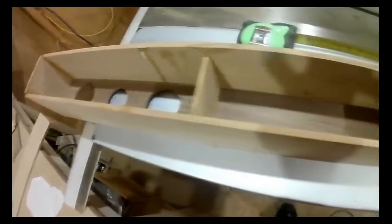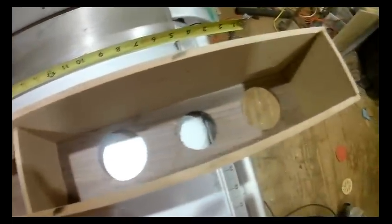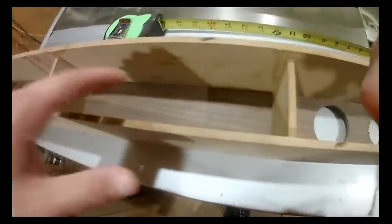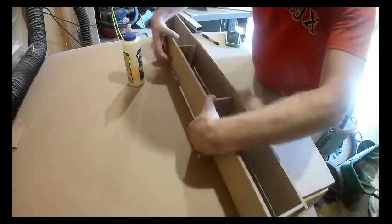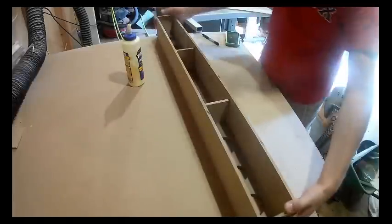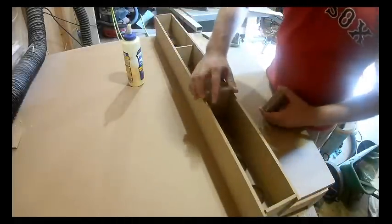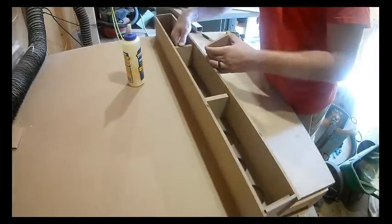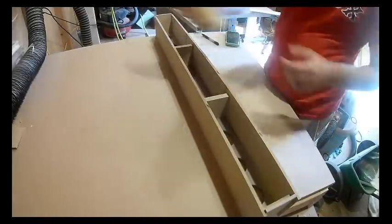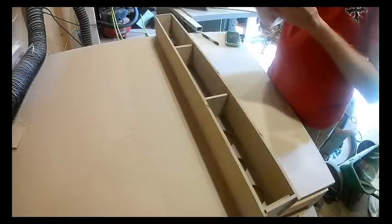Now it's time to create the boxes. We're basically going to have a speaker box on either side of the sound bar, with the middle section housing the crossover components and the amplifier if you choose to amplify internally. Use the front baffle as a guide — where it sticks out about a half inch higher, glue pieces on either side of that to seal the box nice and even.